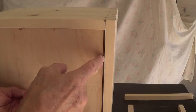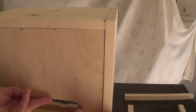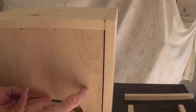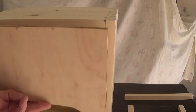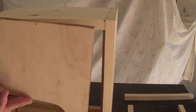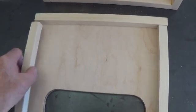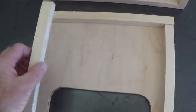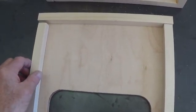As with the speaker baffle, we're leaving about an eighth of an inch of space on the side, which would give us about a sixteenth inch when distributed to both sides, so that we'll have clearance for our upholstery material. Remember, we're going to have one layer here and one layer here on both sides, so it's about four thicknesses of upholstery material. Just like the speaker baffle, we're going to attach the back door using cleats that will be attached to the inner lip of the rear of the cabinet.